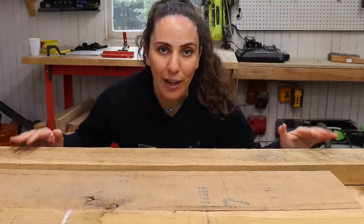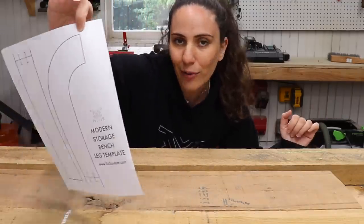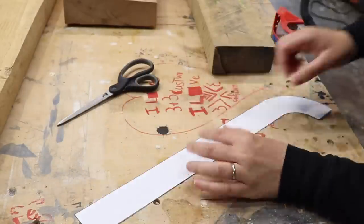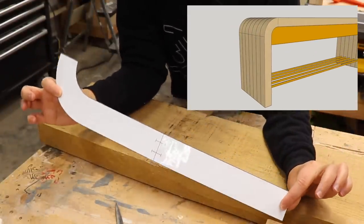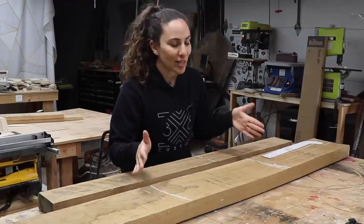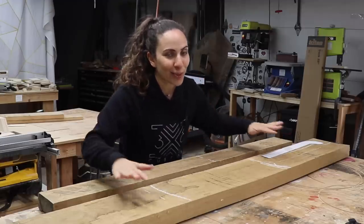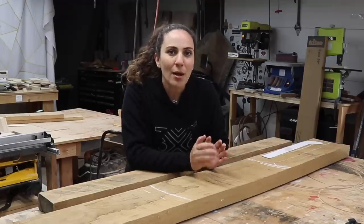I'm going to use this rough white oak. The first step is to mark out where you're going to make all your cuts. To make this easier, I decided to make a template that you can actually download on my website if you want to build this bench. I cut out the two pieces from the template and taped them together at the cross lines. This template is the side piece of the bench, and each side piece needs seven of these. To get the most out of my material, I'll flip the template end to end to create less waste. I split this big board into three 23-inch sections, each yielding four side pieces. I need 14 total, so I had to take out another board. A quick tip: while you're already milling, mill up some extra pieces because you never know what's going to go wrong.